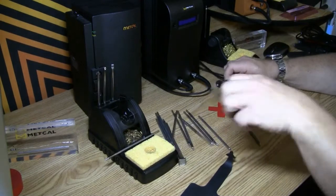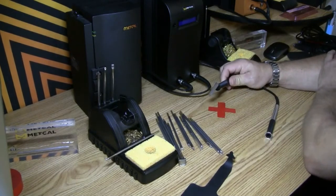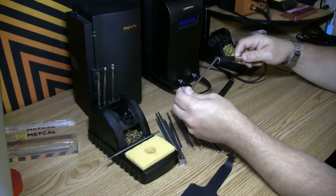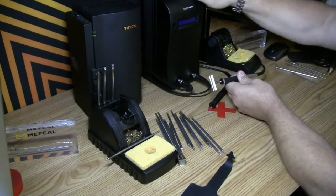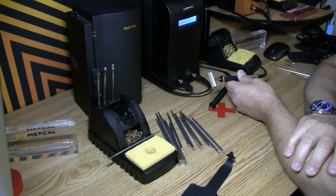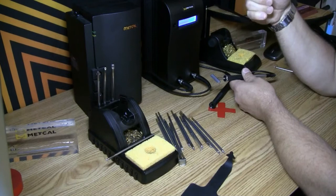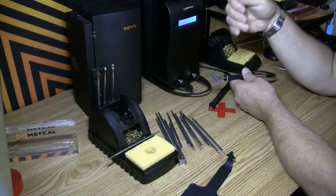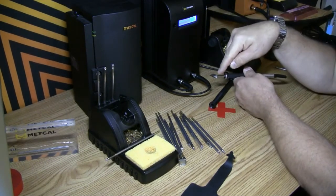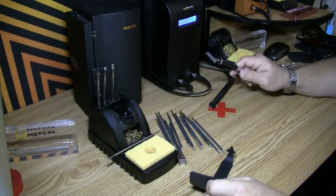Let's say you're doing some BGA rework and this has been your favorite tip for years and years but you just didn't have the heat capacity that you needed. So now you can change this right out and plug it right into your new 5200, and just as before this is going to let you heat it up and it's going to come up to full power fairly quickly. A cartridge with this size and geometry is made for high thermal demand applications on BGA and cleanup, so you're going to be using this with desoldering braid. The cross section of the tip is a little greater, which is going to take a little longer to warm up, but the beauty is — you bought it, you can still use it.